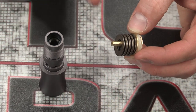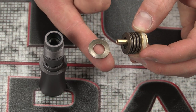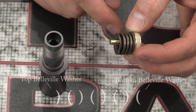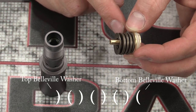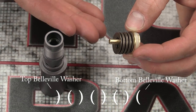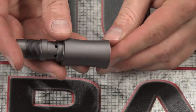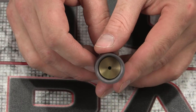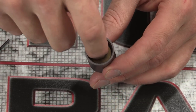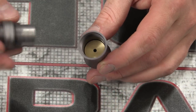If you've never seen regulator internals with Belleville springs — the fact is they're just superior to traditional coiled springs. Each one of these concave discs needs to be correctly oriented, and it's important to make sure they're properly oriented on your piston, otherwise the reg will not work properly. As with any maintenance, wipe down the old grease and any grime or dirt, re-grease, and put it back together. When you drop the piston back into the regulator body, drop an Allen wrench down the middle to get everything lined up, push it all the way down, and reassemble.